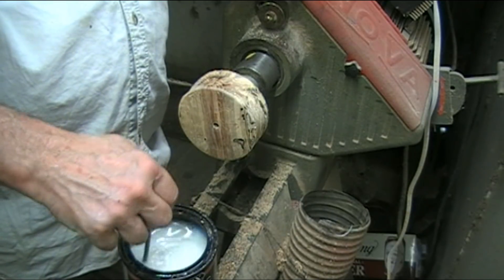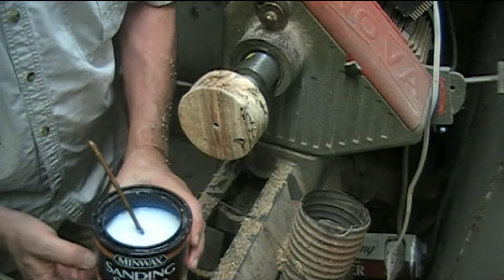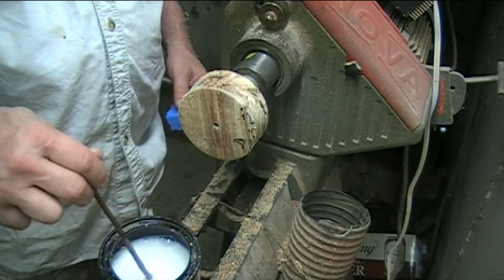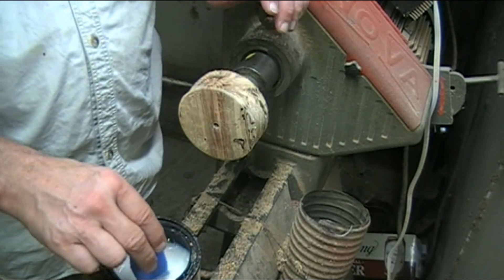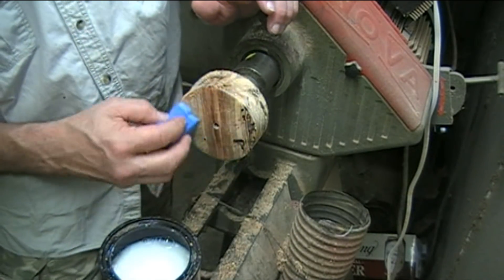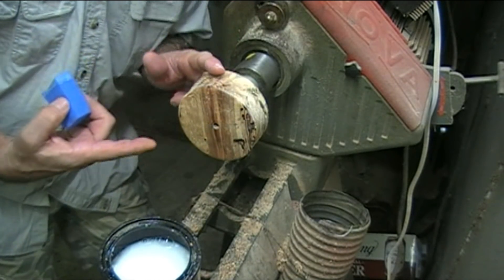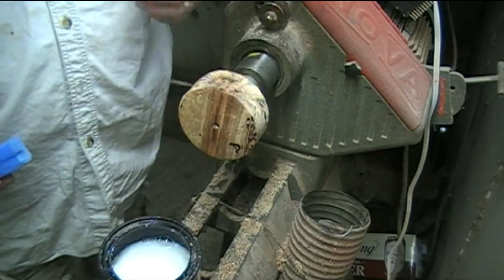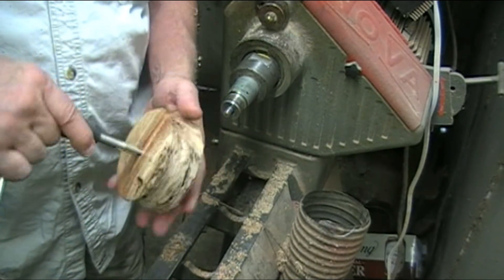The bottom's finished up like I want it. People ask me — I've been using this Minwax, it's water based, and you're supposed to use Minwax stuff with it, or oil or something, but it works really good. You just slop it on. I want to put it on now because it'll be harder to work once I flip this around and hollow it out. Look at that — isn't that beautiful? That's a wonderful grain to it. I'll let that dry; it's going to raise it up a little bit, then I'll hit it again with some sandpaper, flip it around, and re-tap the hole for the other way.